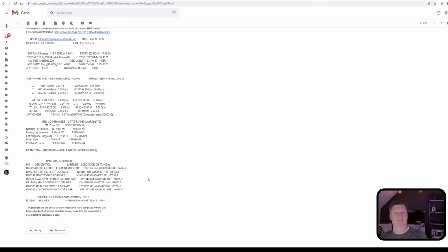And so the reason that I take my rover and put it at the base unit and survey it is because they ought to be within 2 to 3 centimeters. Well, I did, and it was off. I mean, it was a considerable difference. And I went, ooh, I forgot to fix the file. That is a reason for finishing up at your base unit with the rover, because they should be within 2 to 3 centimeters at the very most.